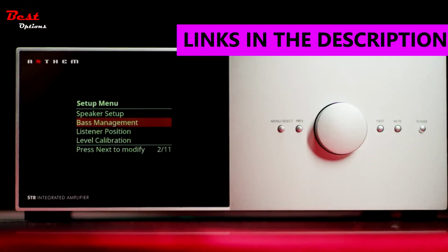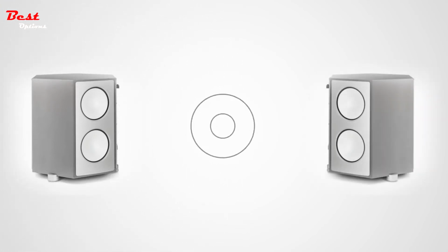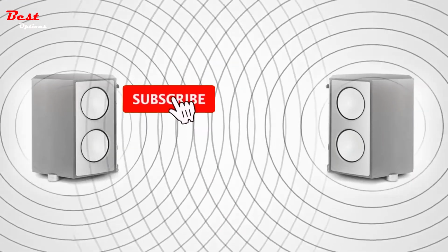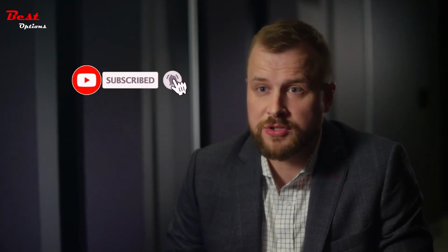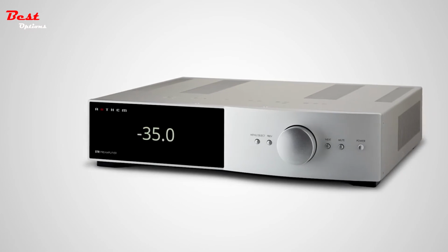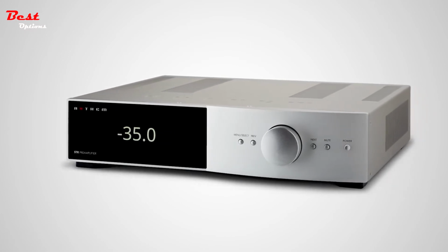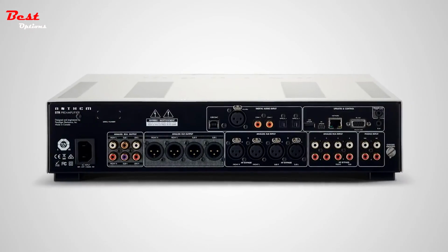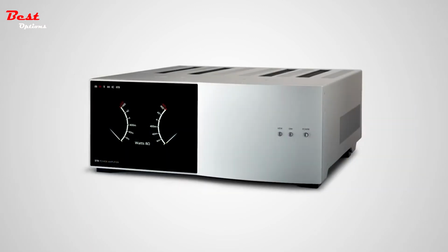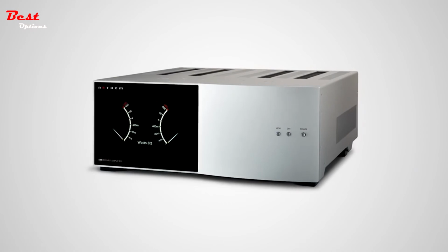The bass management on the STR is something entirely new. You can measure one sub in mono, two subs measured together in mono, or two subs measured independently for stereo bass. Bass management works with Anthem room correction for seamless integration. For users looking for more performance and power, we also have the STR preamp and amplifier available. The preamp offers more functionality, like higher voltage output and a home theater bypass, while the amplifier that accompanies it offers quite a bit more power.